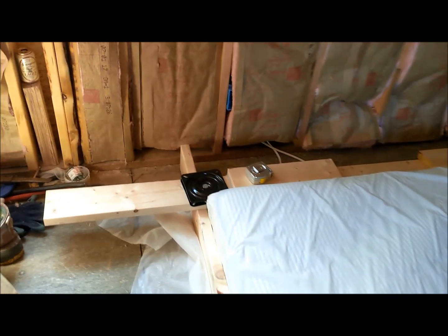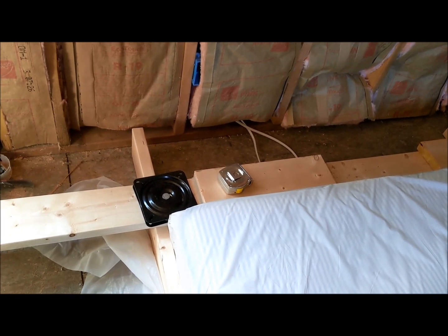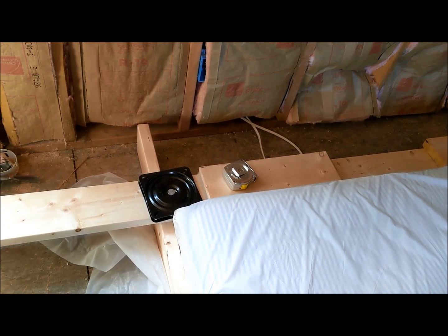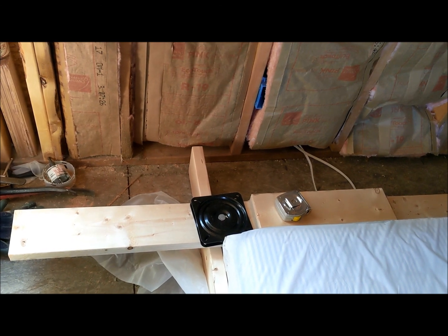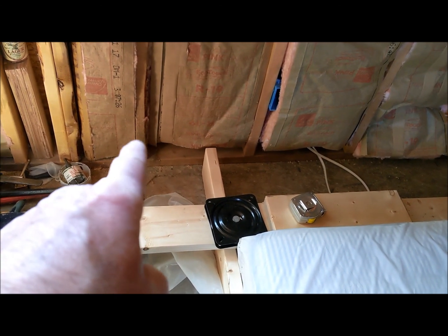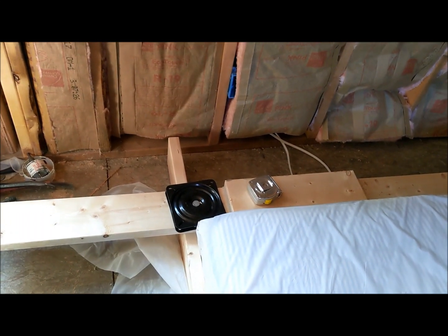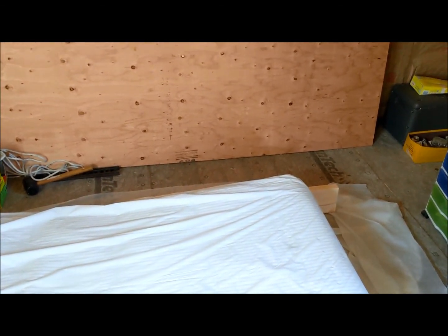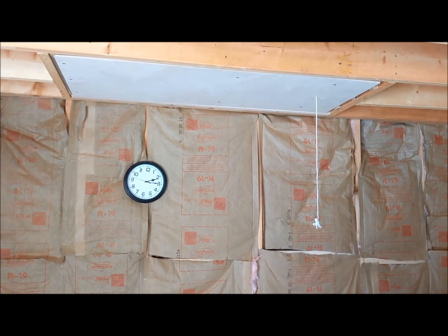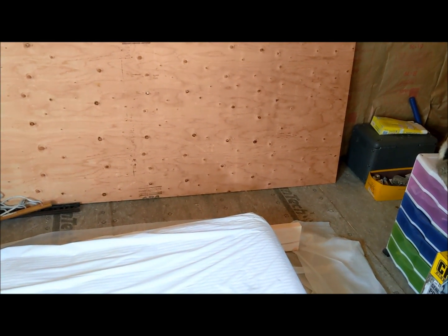And then the black hinge there I'll put up against or in the wall. I'm actually going to come over about 6 inches to the left and tie into that stud there, because over here is where the base of the attic stair comes down. You can see it up there. So I want to leave enough room over there so there's some space.